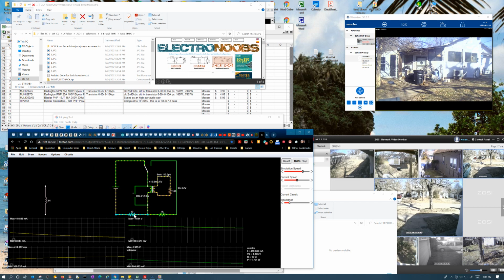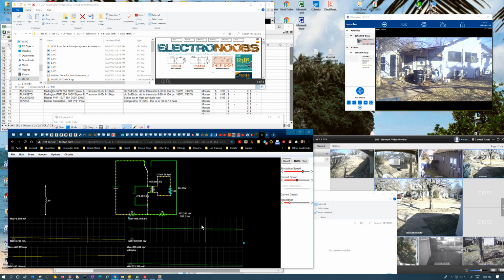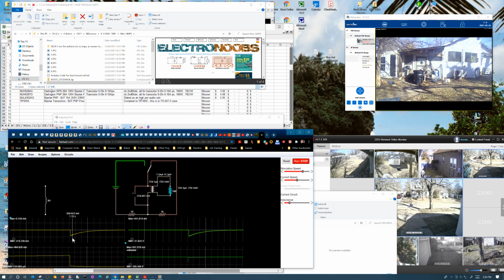But here, I'm demonstrating that just like with these resistors, this actually takes the place of it. So if we have this 10-to-1 ratio, this is behaving the same way this did, in the sense that it's sharing the current. At a 10 to 1 ratio, that's why this has got like 50 volts when I do this. It's going on 50 volts, and it's maintaining that at 500 milliamp current or whatnot. So it's behaving like I thought it would.